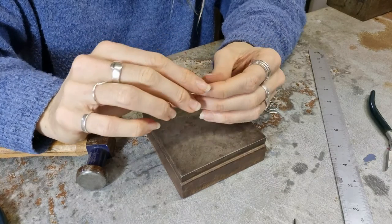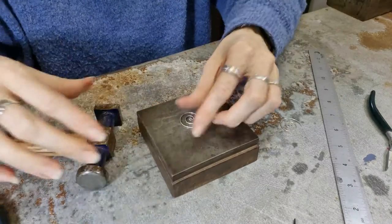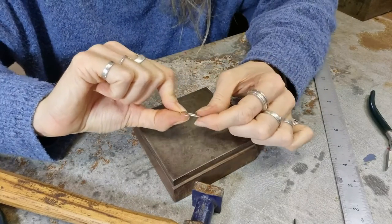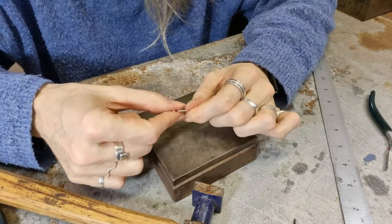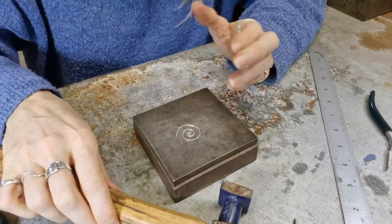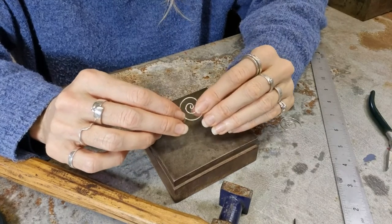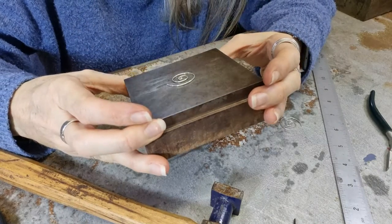I give it a hardness test - I squeeze it. There'll still be a little bit of give because it's like a spring, but it should be pretty hard at this point. Another important thing is to ensure before you start hammering that the spiral is already flat on the plane, because when you're making it you might have pulled a bit up or down. You want to adjust and make sure it's flat before you start hammering. You can do that with your tools, or you might need to manually adjust it with your hands if a piece keeps kicking up.